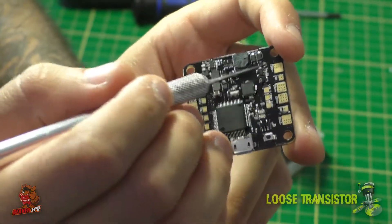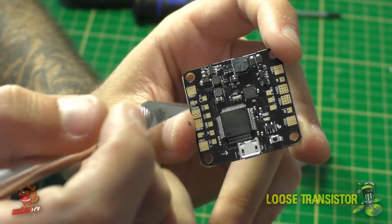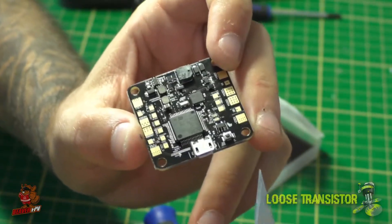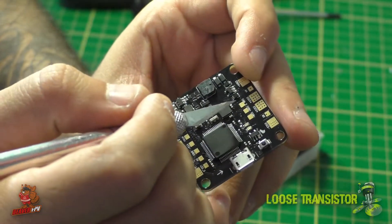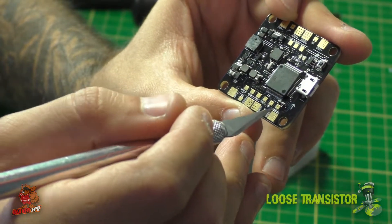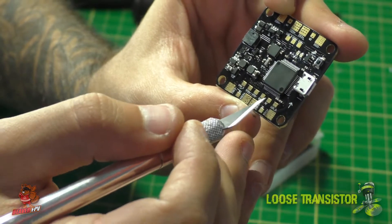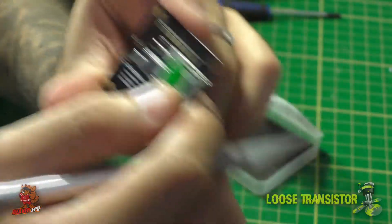On the top we have ESC pads along the sides, making it super easy to solder, with motor signal pads right in between each motor pad. This layout literally saves me at least an hour or two on build time — it's just deadly simple and so well laid out. There's a nice boot button so you don't have to short anything. There's also a camera pad sending 5V, camera signal, and ground, and down below are your VTX pads — VTX plus and minus on the 12V rail — plus VTX signal, LED signal, 5V, and ground. Everything is extremely well laid out with nice big pads, nothing through-hole, and it's been working fantastically.